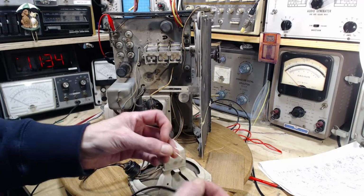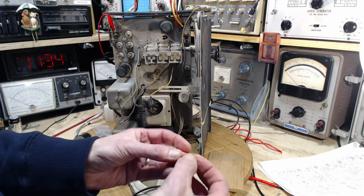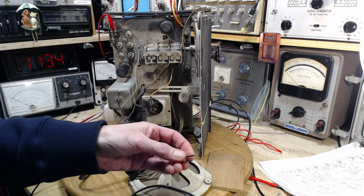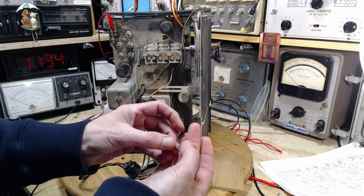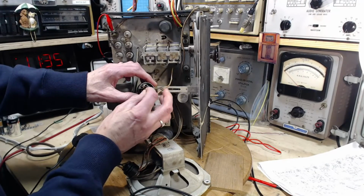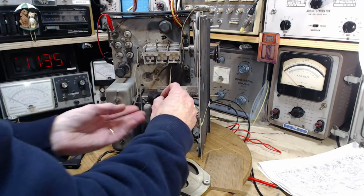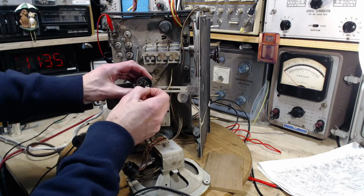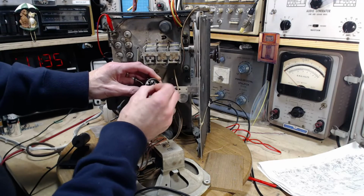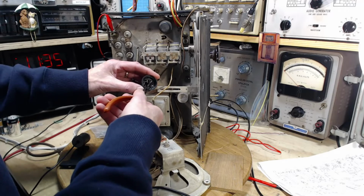So we're going to cut this wire way back, so we don't want very much on there. Wrong end. There we go. And we're going to shove that down here. This is a larger resistor. It may not get quite as hot. I mean, it still generates the same amount of heat energy because the resistance is the resistance. But the larger resistor body may throw the heat off more efficiently.